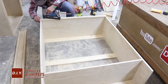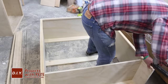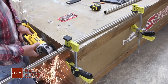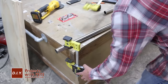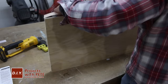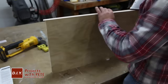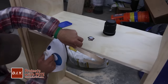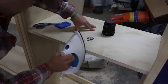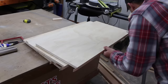The trim went around all four sides of both outer units and the center unit, overhanging to the inside and flush with the outside of the plywood. I bought an eight-foot long nickel rod and cut it down to make two rods — a cutoff blade or hacksaw will make quick work of this. Edge banding was used to cover the front of each shelf. Cut the banding slightly longer than the shelf, then use an iron to go over it, which heats up the glue and sticks it to the face of the plywood. Let the banding cool down after it's applied, then use a sharp razor blade to trim off the excess. You can follow up with a light sanding if needed.